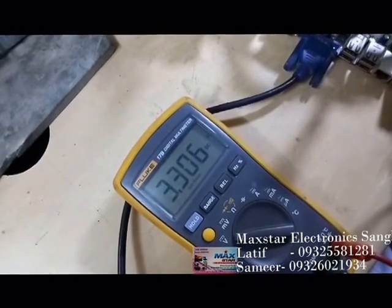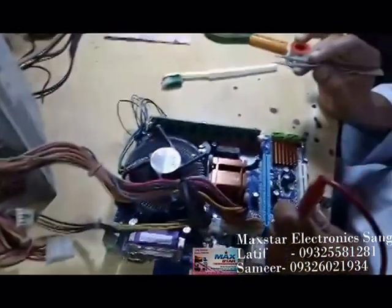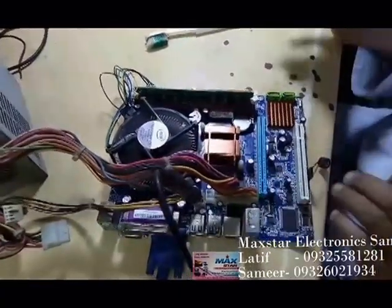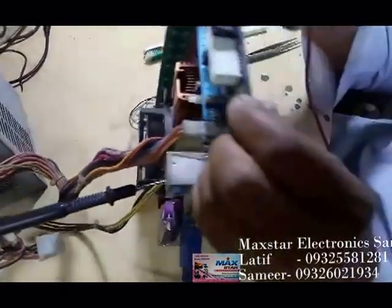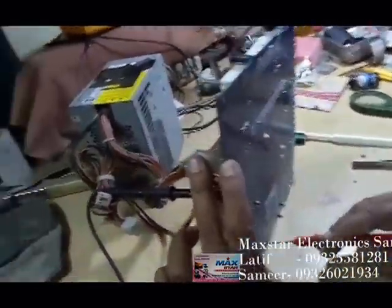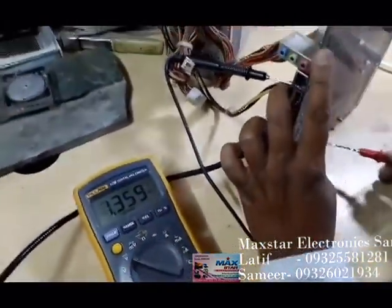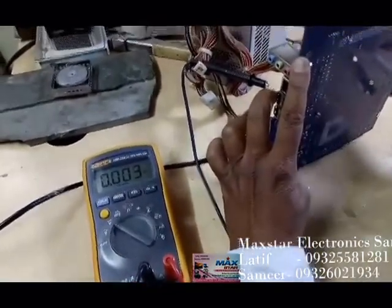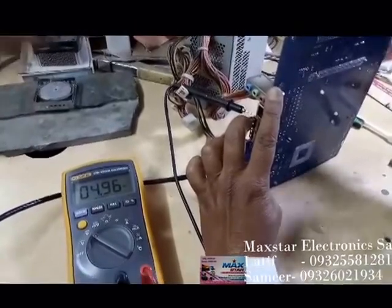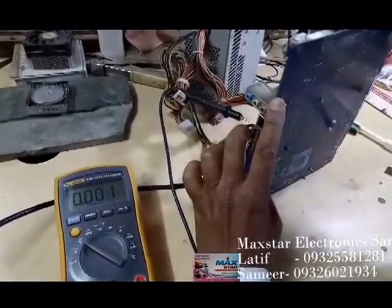There is a doubt in this case — what we understand is that this may be a BIOS issue, but BIOS is okay. Now I am looking for the voltages, core voltages. It's correct. All voltages are okay. RAM supply 1.9, that means 1.8 is okay.